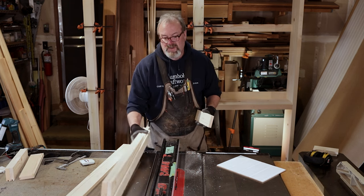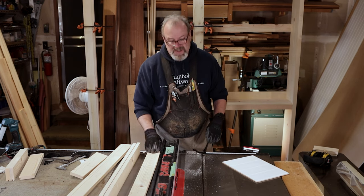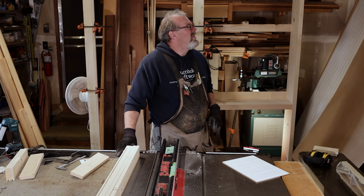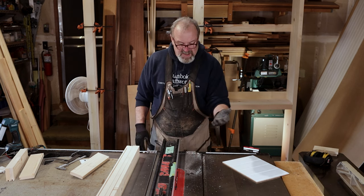All the pieces are made. It's the world's simplest, easiest door to machine, just using your table saw. You could do the exact same thing if you have a contractor saw, if you have an 1/8-inch blade. If you don't, you just make more passes, that's it. Squeaker says it beats buying a router table or a shaper to make your doors. You just use your table saw.